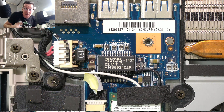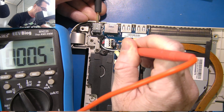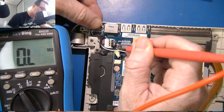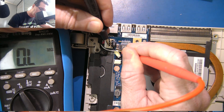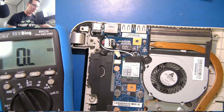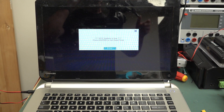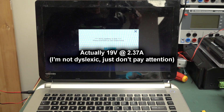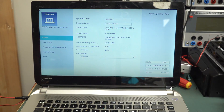Let's probe up the clacker and see if that gets through — it does. It gets through to the fuse, and to the other side of the fuse. Bob's your uncle. Hopefully we can power this. Let me check the other side to ground — no, that's all good, it's not shorted on the other side of that inductor. Let's give it a bell. Winner winner chicken dinner. And to date and time — we're in. Toshiba setup utility. The 512 gig is recognized.